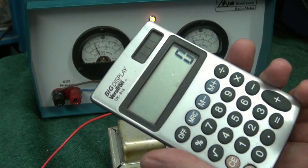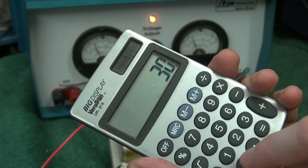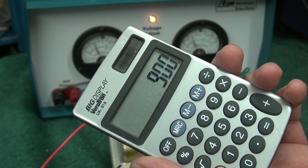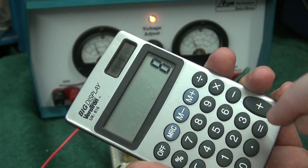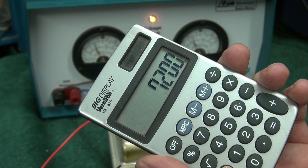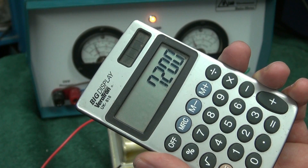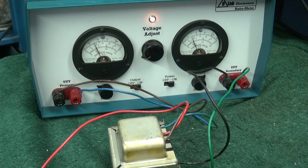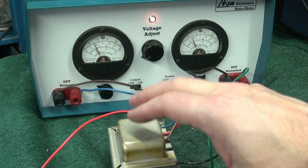So if we take our trusty calculator: 30 volts times 30 volts equals that magic number, and I've got an 8-ohm speaker. So 30 times 30 times 8 equals 7,200 ohms of impedance — which is perfect for a set of 6V6s. So this would be the proper transformer.